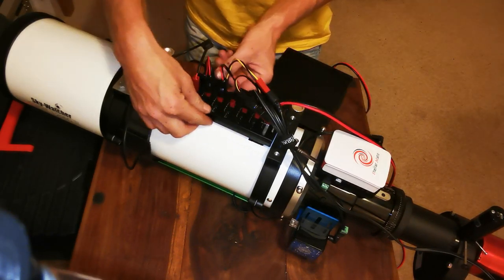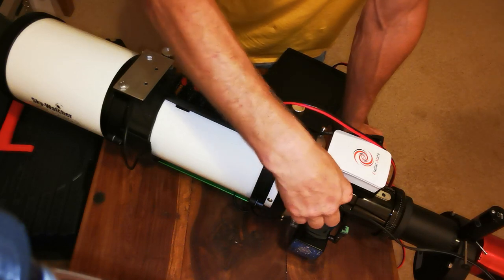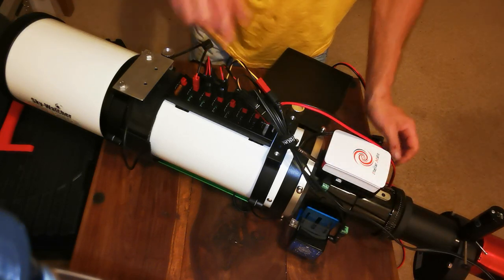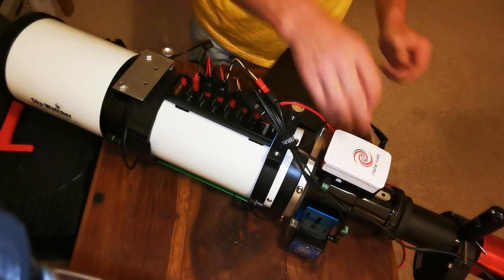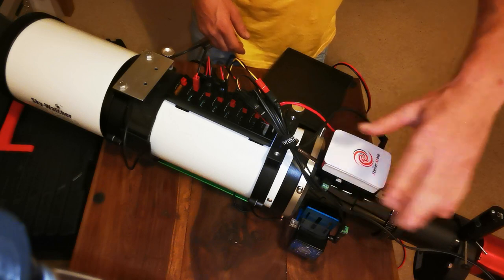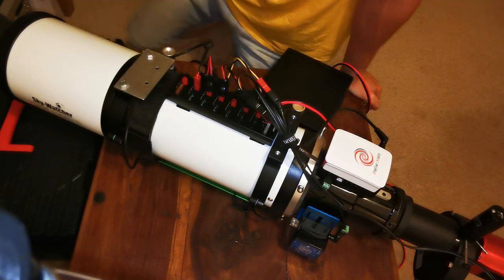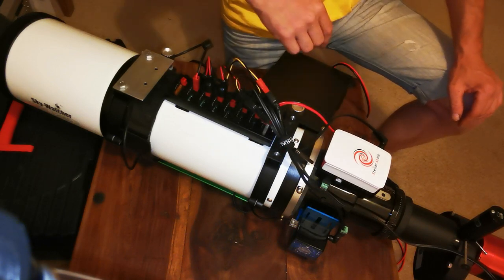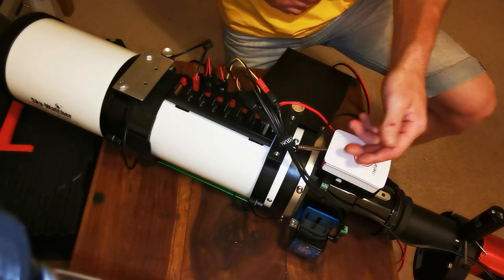It's riding on top here. We've got our two converted 5-volt outlets - one to the USB hub down here, with the USB ports actually on the opposite side facing me, and the second one going into our StellarMate. So we've got the USB hub and the StellarMate riding there - these are very plastic and lightweight, don't weigh anything. All I've got to do is put the correct fuses in for the correct amperage of the equipment. Just put one velcro strap on this bunch here and that's nice and secure. I've included the Pegasus Astro focus cube weather sensor just hanging in there.